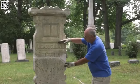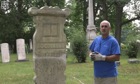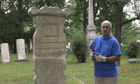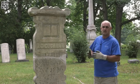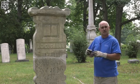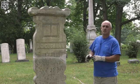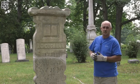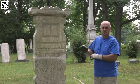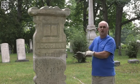So these 2 pieces, and down here we use an Italian epoxy, and that's what I learned on, and that's traditionally what I stick with. It's called 10X. It's a real good epoxy, and it comes many different ways, but we use one that cures in 7 minutes, and then one that totally cures in 24 hours. The difference is the 24 hours will go minus 30 degrees, where the other one is only to 0. But the quick is so you can go on to another one while this one is drying.